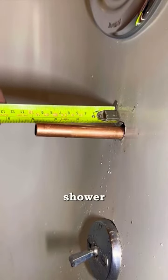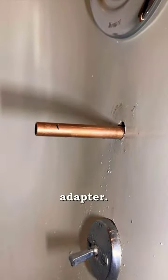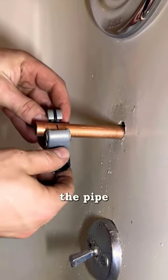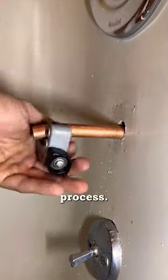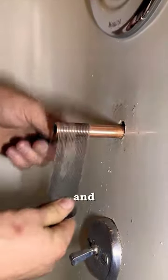Here's an easy way to install a shower tub spout using a universal adapter. I'm going to start by shortening the pipe to three inches — this is probably the most difficult step to the entire process. You just need a tubing cutter, and then you're also going to clean it and deburr it.